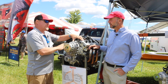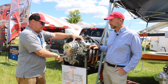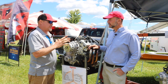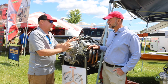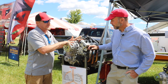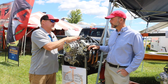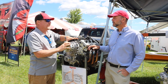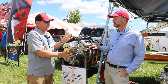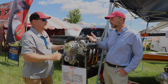We're starting to find that the stock seals and bearing seals Yamaha provides are a pretty good barrier, so we're considering revisiting whether we need to match crankcase vacuum at all. We're now doing some testing with the gearbox vented atmospherically instead of equalizing to engine pressure. One reason we currently run the same oil in this gearbox as engine oil — whatever you're running in the engine — is that we are seeing some oil vapor transfer from the gearbox to the engine. If you use the same oil, any vapor mist that condenses and transfers into the engine is not a contamination issue.